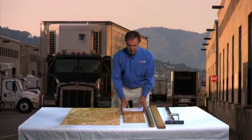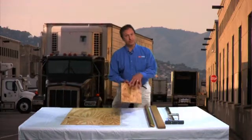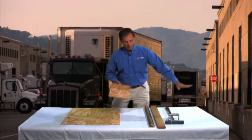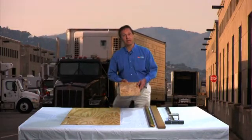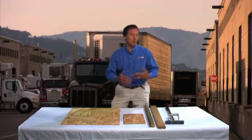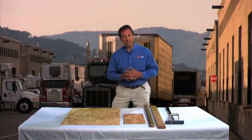Another popular wood used quite a lot is this wafer board. They use a lot of this wafer board in lining shelving or work tops in many industrial applications. Another thing to keep in mind is that wood also emits oil. This is another thing that creates a challenge when you're bonding or attempting to bond with a pressure sensitive system.